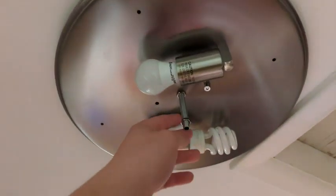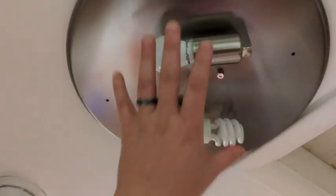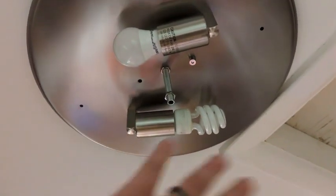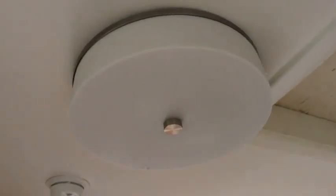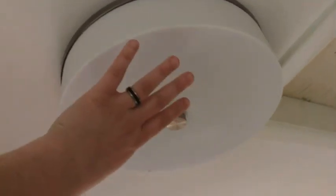To get the cover on, there's a threaded rod where you actually take the plastic piece up. There's also a nut on there that kind of keeps the whole thing together. Let me show you how that works. This is what it looks like fully installed — this outside plastic cover just kind of slips over that threaded rod. It's actually threaded, so if you spin that off, it'll back off and the whole unit will drop down. That's how you change the bulbs on this.